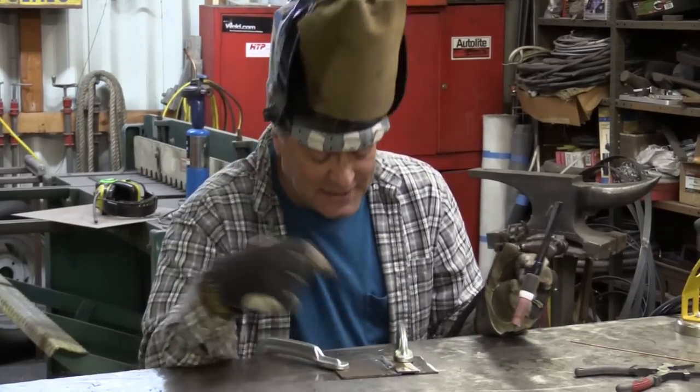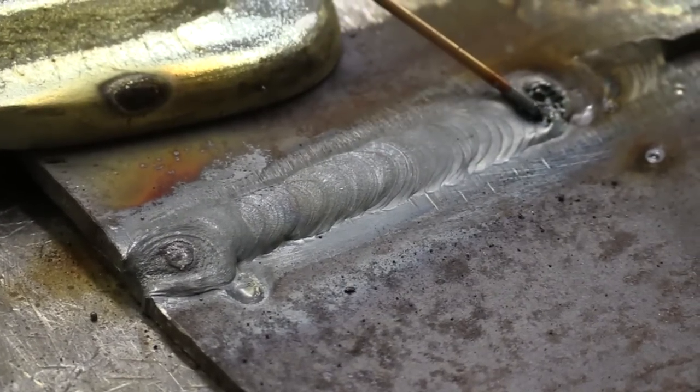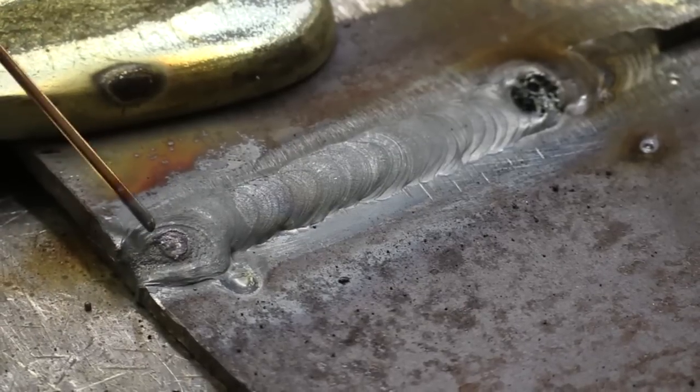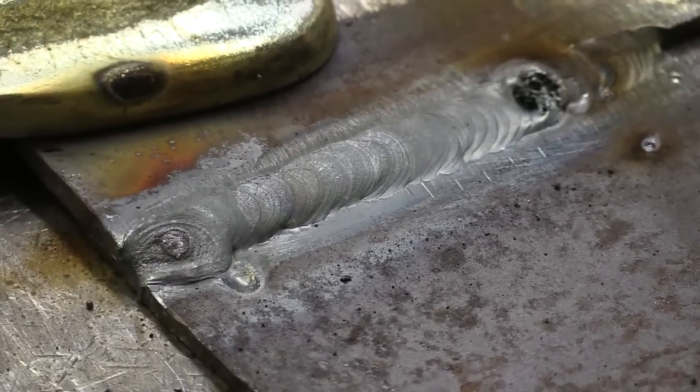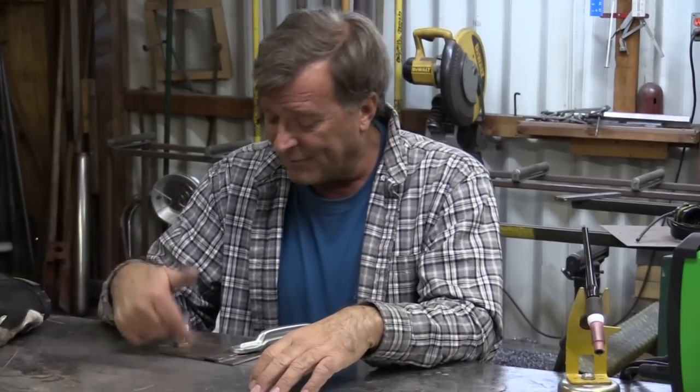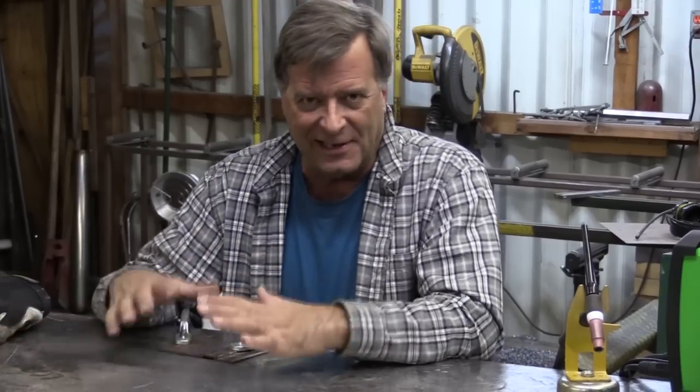Yeah, come here, check out the weld. It actually did a really nice little job. That's where I started right there — forgot to turn the gas on — and then ran along there. That's where I kind of goofed when I pulled my hand away. But you can see it does a nice little job. The machine was set at about 90 amps, running a 3/32" quad 4 tungsten from the good guys over at HTP Welding, plugged into 220, working on a little piece of eighth-inch plate pulled out of the scrap bucket. Clean up the edges, clamp it down and what have you.